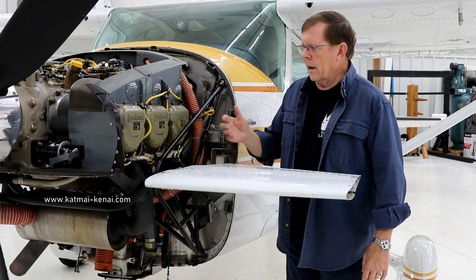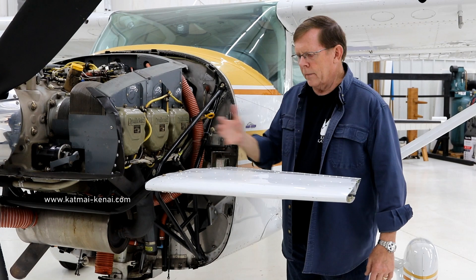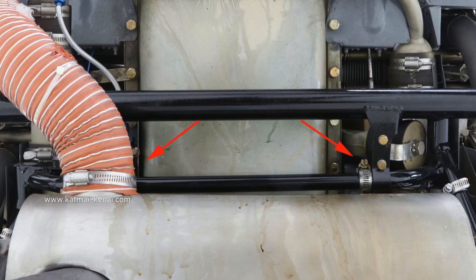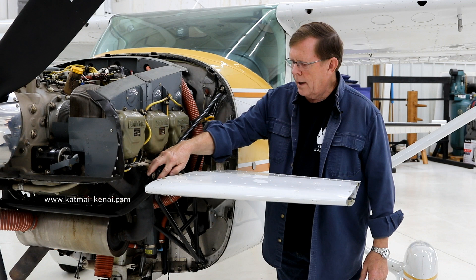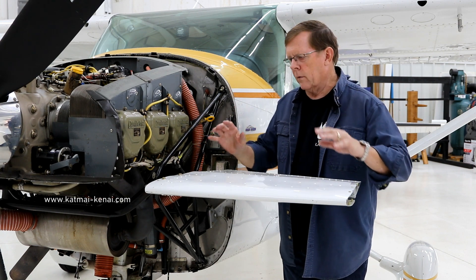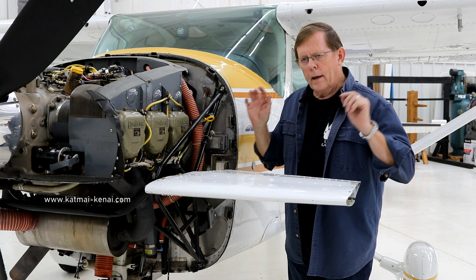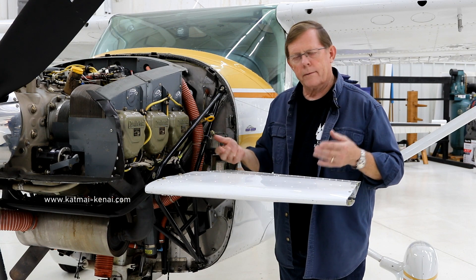The other thing is if you're in maintenance and you have to pull a cylinder, obviously some of the canard mechanism has to come off. What I do is take the clamps loose that secure the spar to the front engine mount crossmember — those clamps that keep it from sliding side to side. Then I'll disconnect the push rod and take the two bolts, top and bottom, on each side off that hold the canard spar to the side frame. Then I take the entire unit off as an assembly — the spar with the canard surfaces, stabilizer, and elevator still attached on both sides. I just take the whole thing off as one unit, which makes it nice and clean and easy. When you put it back on, all you have to do is hook up some stuff and you're ready to go.